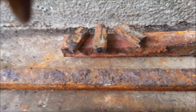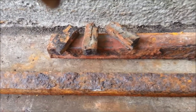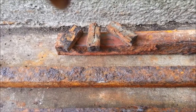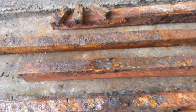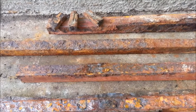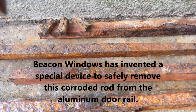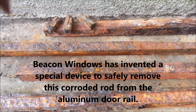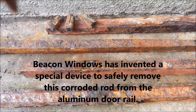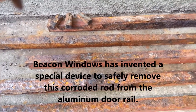Sometimes when we get into it, we also see chunks and pieces that fall out. There's so much corrosion going on that they actually have chunks and pieces of metal that come out when we have to take it apart. To take apart this steel from the very soft aluminum rail at the bottom of your door is rather tricky. So we've developed a special product — an invention we made just specially to take these types of weights out of the bottom of your door. Because we're able to do that, we're not going to break the door system apart. But you do need to remove these for you to have longevity on your door systems. It's not something you want to take lightly.